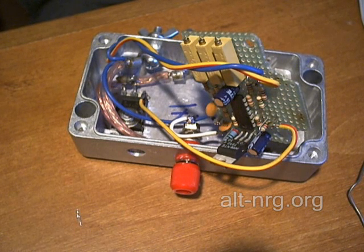The actual layout is correct, but the labeling of the potentiometers is reversed, and in so doing, I assembled the potentiometers to the perforated board in the wrong order.